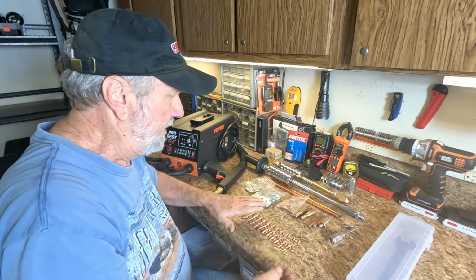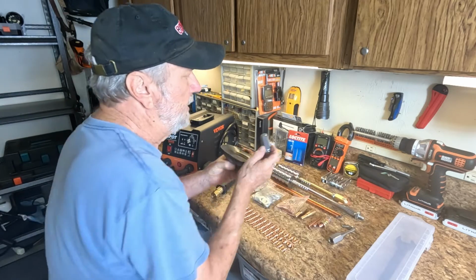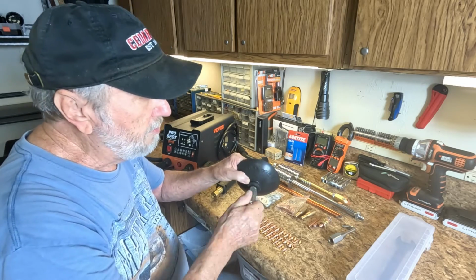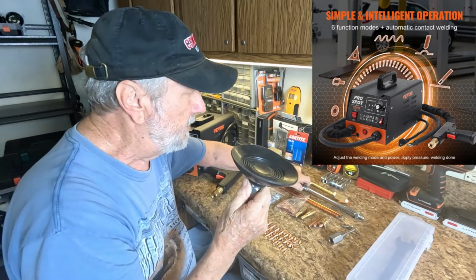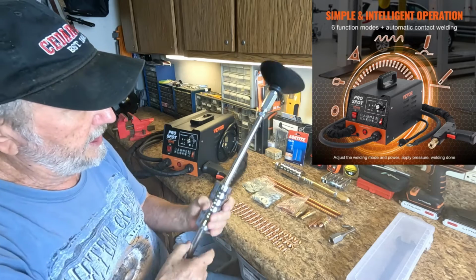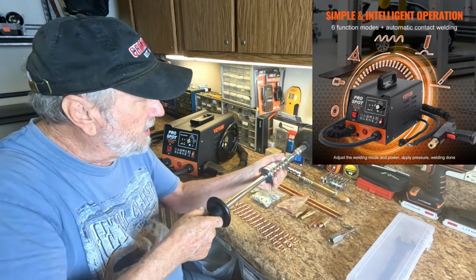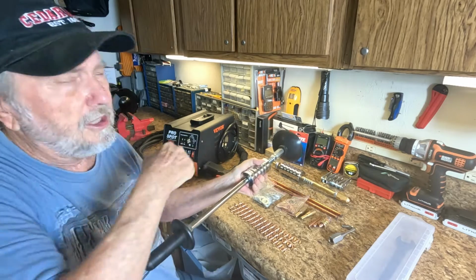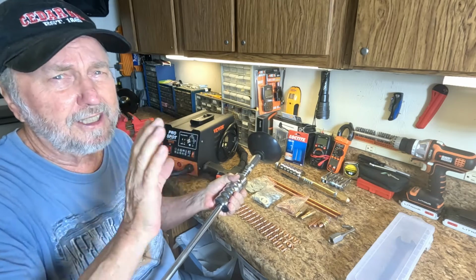And also, in addition to these, you get this suction cup, and right here this is going to mount here to couple it on, and chances are you may be able to remove a lot of soft dents where it's just pushed in and not have to weld anything. So they give you this, and you just simply put it on the end of this, like this. I'm not going to go all the way. And this is a slide hammer. You stick it into the dent where it's recessed and get it nice and wiggled in good. You could even moisten it if you really want to, but I don't think you need to. And then you bam, and what it does is it pulls that dent and it'll just pop right out. I'm sure the people with the skills have already seen this in action.